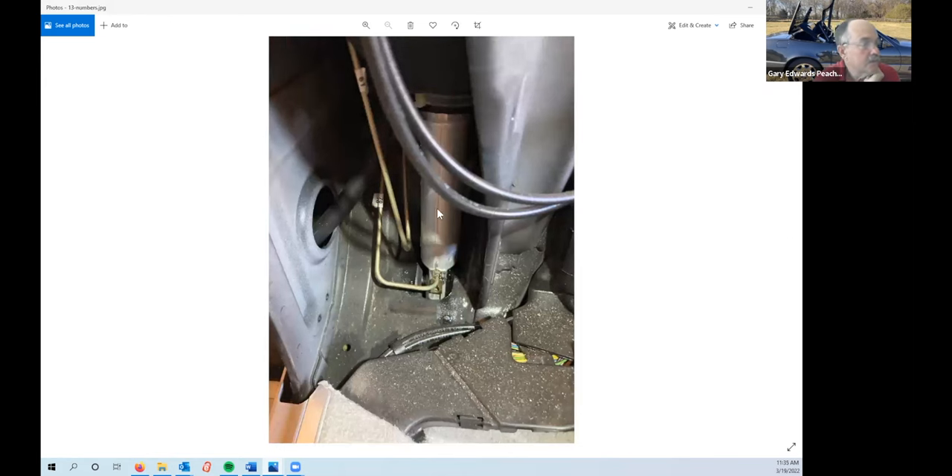Here's a main cylinder — you can see there are numbers on the line. On a main cylinder you're never going to get the hydraulic lines screwed up because the ports are so far apart. But on the previous cylinder, the ports were very close together and it would be physically possible to put them in the wrong port. You also need to pay attention to how the hoses got routed — it is physically possible in some of these to put the hoses on the wrong side of a bracket when reinstalling. Take a picture and make sure wires and hoses go back in the same place they came out of.